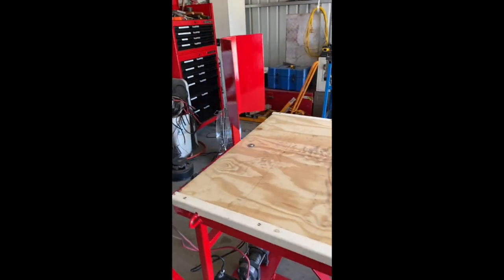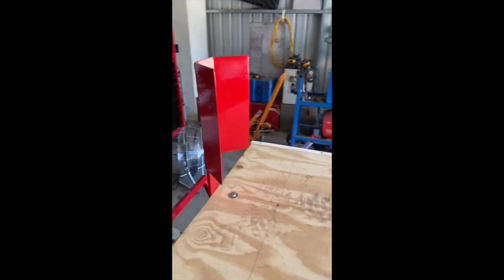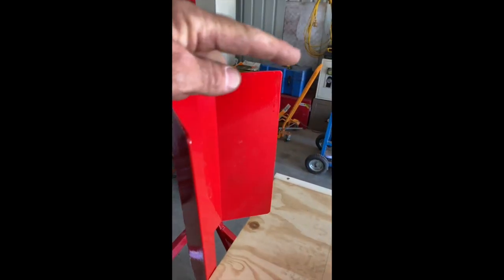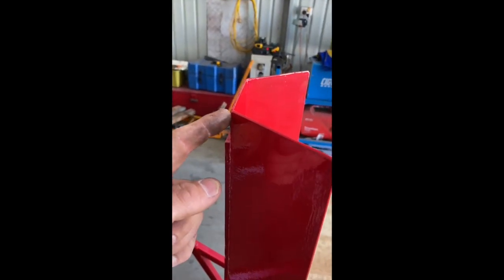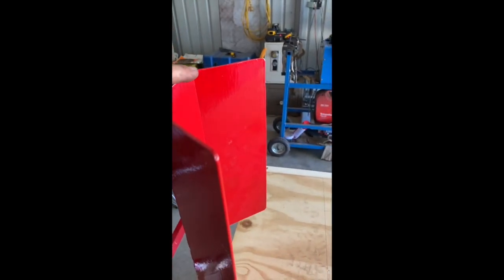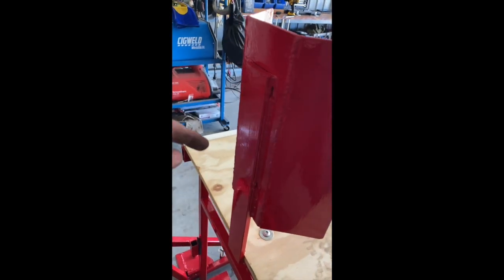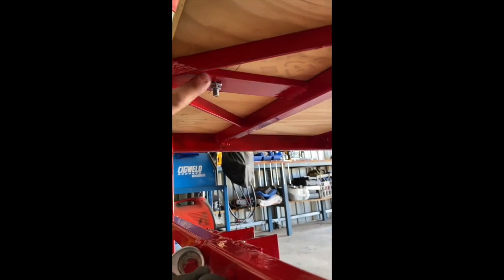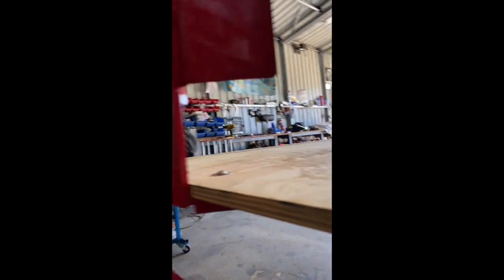At the top end we need a stop so the bike's front wheel doesn't go over the edge. I used some 3mm plate, cut it to size with an angle grinder and cutting blade, cut halfway through the 3mm and bent them into shape, measured the angles so they're equal, then welded them down the back on both sides. That's welded to an L-shaped piece bolted in place, with supports on each side also welded in to provide extra rigidity — it's not going anywhere.